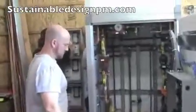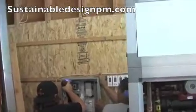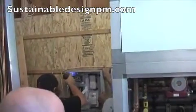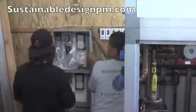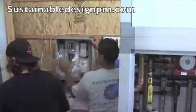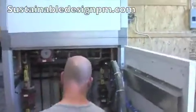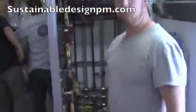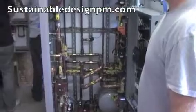These guys right now are taking off the fan control units, which is a delta DAC plus pressure transducer plus control transformer. Basically that attaches to the fan coil out in the field. This is all getting delivered tomorrow morning, probably installed over the course of the next couple of months, and we'll probably be starting it up before the first big rains hopefully.